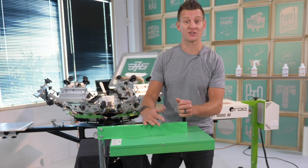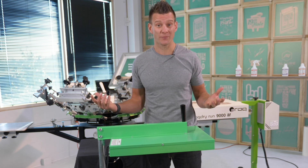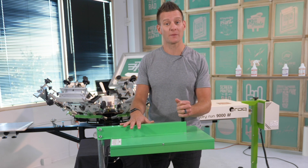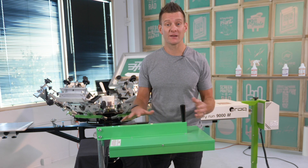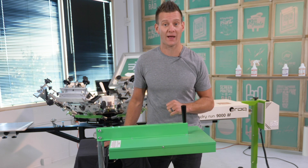There are several different types and quality of flash infrared heat on the market. There's a coil panel that essentially uses an oven coil, which isn't very consistent, and there's a higher quality one like what we see here in a BBC flash dryer, which is a baked infrared panel. In my opinion, the BBC flash dryer makes the best infrared panel, giving you a consistent overall flash.